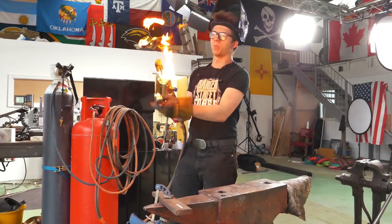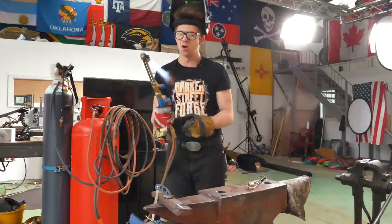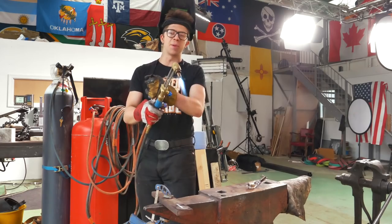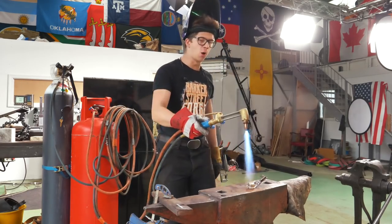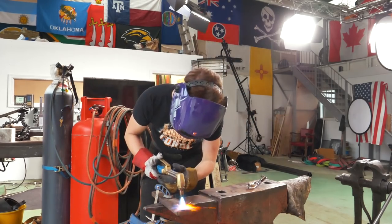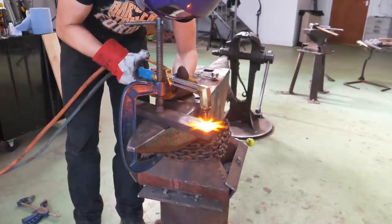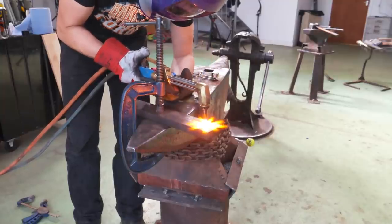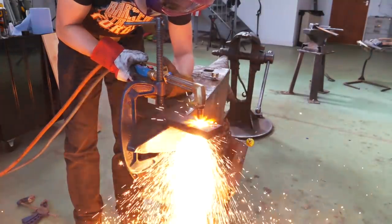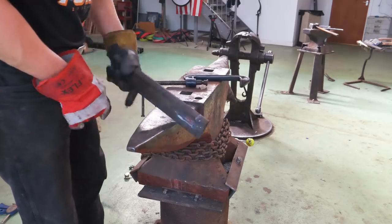Once I start my propane flame just like that, I'll open up the oxygen ever so slowly. When I hit the bypass it pushes oxygen through at the full pressure of the hose — that shoots a jet of oxygen through, punches a hole, and then it will burn its way through. I'm preheating where the cut is gonna go so it's all a little bit toastier. Now we're gonna let it get hot enough that we're just bubbling the surface — and then I poke a hole right now. We'll draw her back and start making that slot. That's a very un-blacksmith way to make a slot, and a very ugly slot at that. Let's throw it in the fire and drift it.